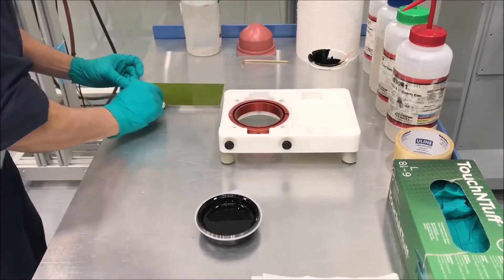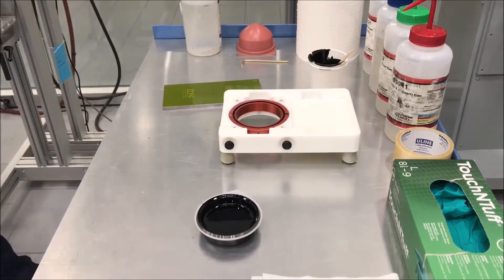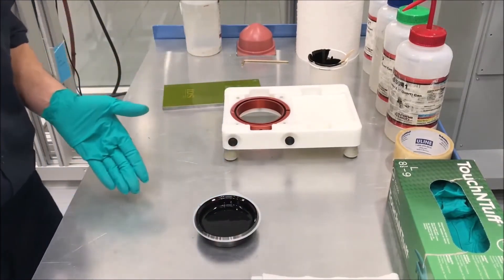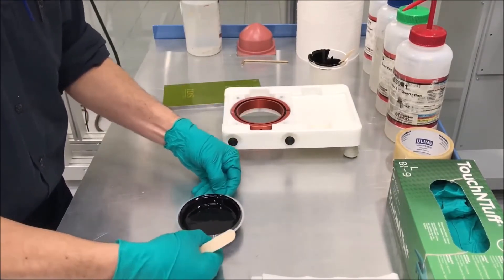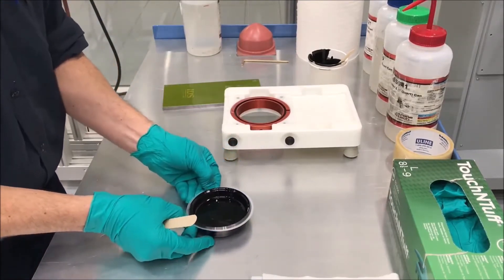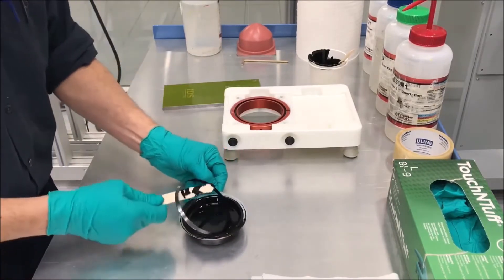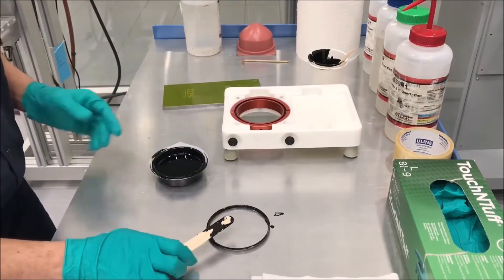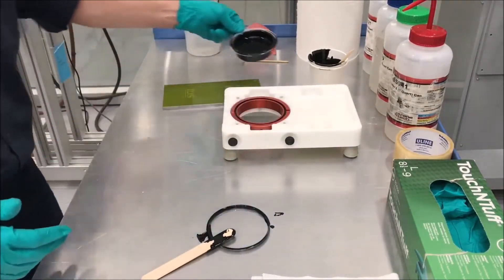Right now I will just wipe down the plate so it will be all set and ready to go. For the next setup, what I like to do is use a mixing stick because it's made out of wood — just press down on the liner a little bit with your finger all the way around to loosen it up. Then take the stick, do the same thing going around it, and just take it off and put it upside down on top of the stainless steel table. If it's single component ink you can save the ink or start new.